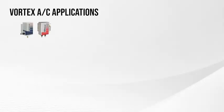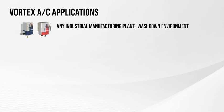Well, for the NEMA 4X, any manufacturing plant that is in a washdown environment where they have electronics. Today, everybody's trying to put all these electronics in the smallest enclosure that they can. So when they do that, you're going to have a lot more heat that you have to deal with so that you're not having issues with sensors dropping out or motherboards failing. So just about any industrial application where you have compressed air available, and the BTU range is anywhere from 900 BTUs or less all the way up to 5,000.